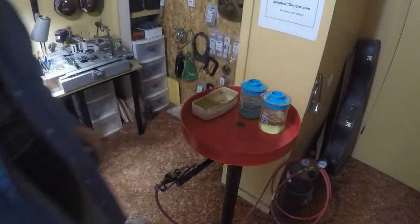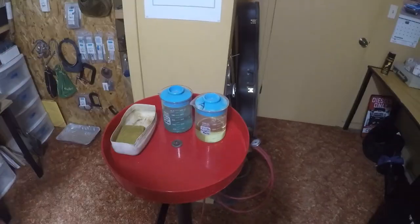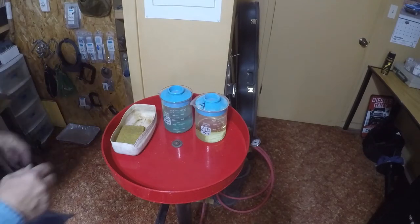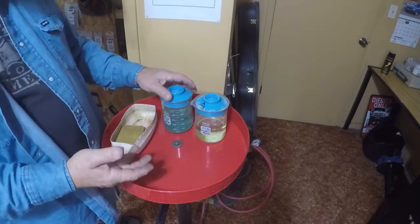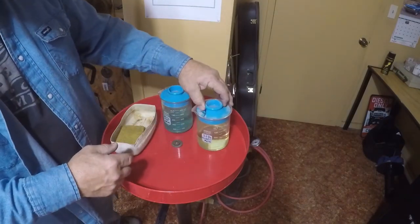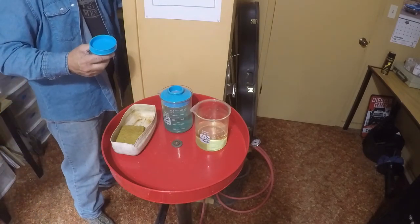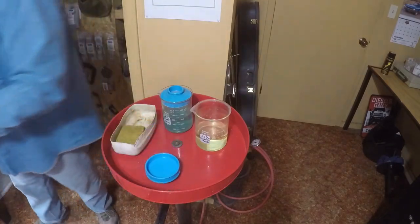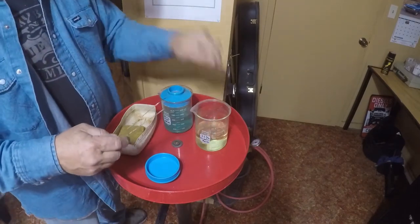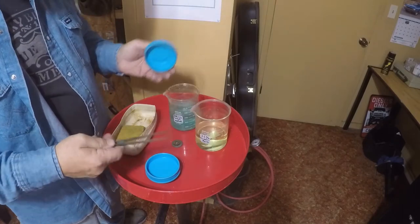I'm going to show you how I clean things up after I solder. I'm not big on pickling. I've always used 25% muriatic acid in a beaker and baking soda to neutralize the acid. It's worked for me. I know it's smelly, and if you spill it, it can really eat through your floor in a hurry. But I'm real careful with it, and that's what I use.